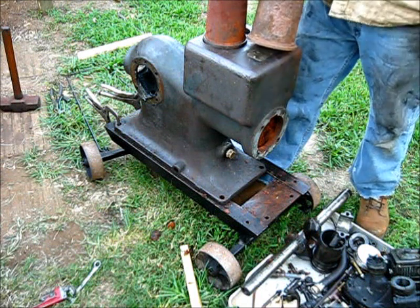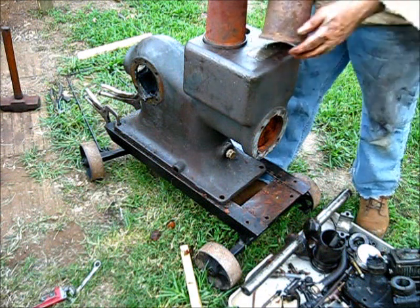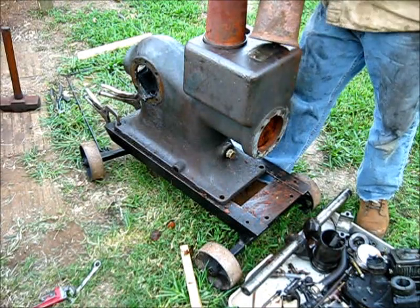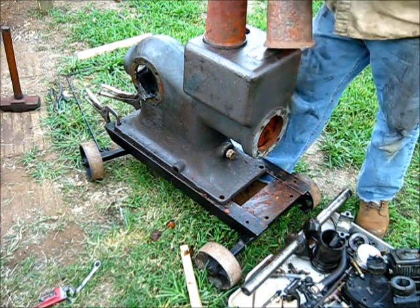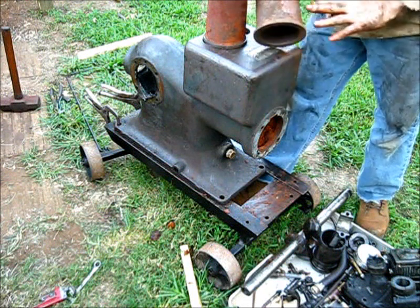The engine owner says 'oh, that's good' — well, actually it's not. It's very bad because the cylinder rust is where that water line is at. And this is a good example right here on both sides. It has a rust line right here — really rusted a lot down here and not much up here.